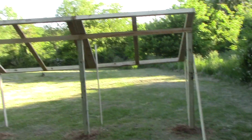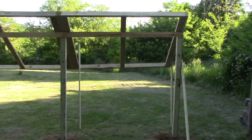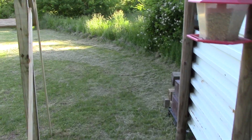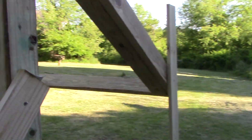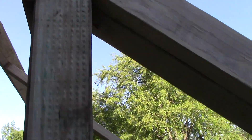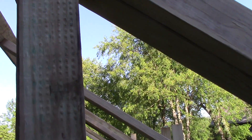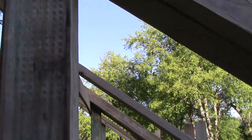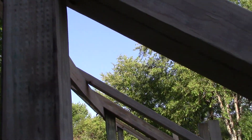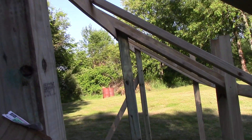There's the solar rack — we're pretty good. I'll show you what we did here. These 4x4 posts are in 3 feet, cut at about 55 degrees. 62 degrees is optimum, but I left it down a little bit so that as the days get shorter it's still going to pick up plenty. We're not going to be out here much during the winter anyway — it'll get plenty of light.